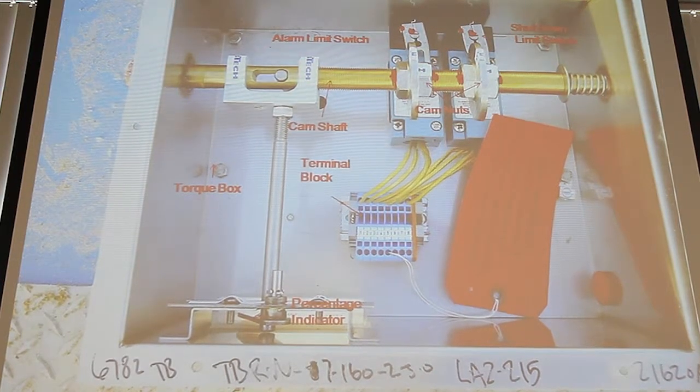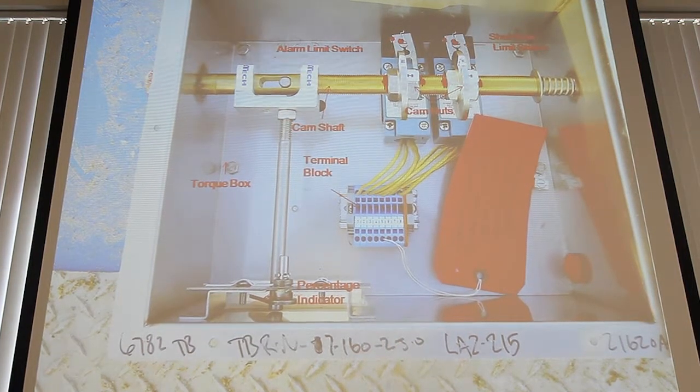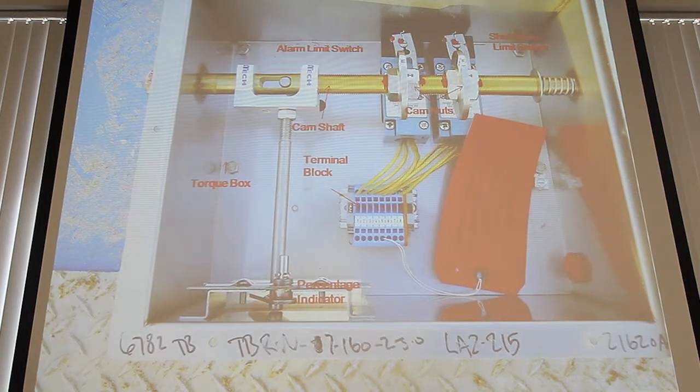Is that when you bought the last unit, 1989? Yes. So all three of these units were done in 1989. So, yeah, they are getting pretty old. But new drive units, you should probably, I think I heard you wanted another 15 years out of them. However long you can get out of them, right? Yeah. So as long as you keep corrosion down, that's really your worst enemy. We got 23 years of service out of the last one then? Yeah. The drive units are designed for 20 years of continuous running. The bearings are, but we have some units that are running 30 years plus. So it really just depends on maintenance and comes down to how much wear and tear they've actually seen over their life. So, any questions on this stuff?